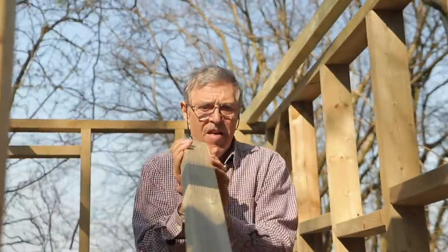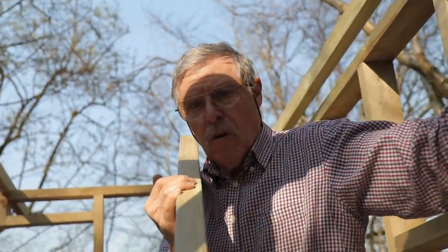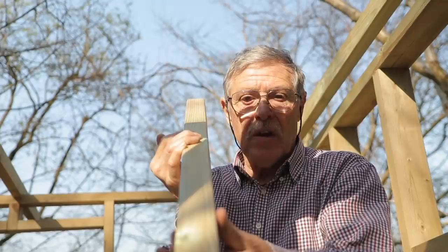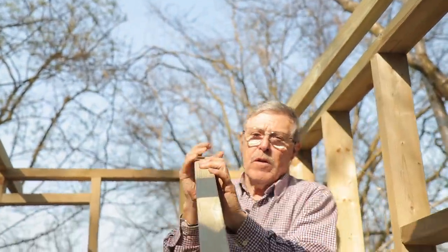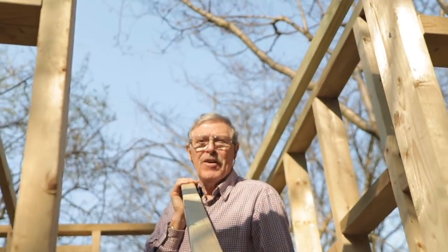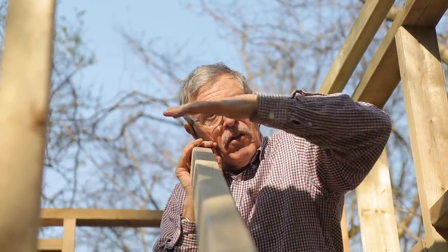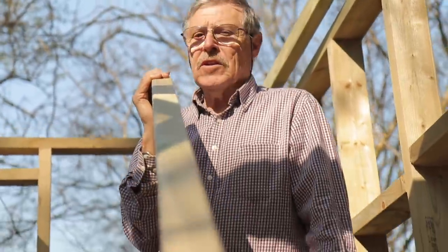What are you doing there, Dad? I'm just turning it around. A lot of modern wood, when you go to the DIY stores, you've got to see where the twists and all the rubbish bits are, which bits have been busted out by the forklift truck driver. So you want the best you can get. But somebody also told us about the crown of the wood. When you do a roof, you go on the top. We find that when you look down it, because we've already put two up there the wrong way round, there is a very slight bow and a dish. You probably won't see it with the camera, it dips down on this curve and that side rises a little bit. It's very, very fractional, but we did see on somebody's site, they said put the roof up with the crown upwards. So that's what we're trying to do.